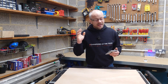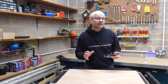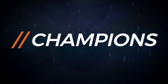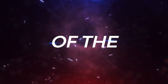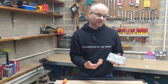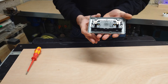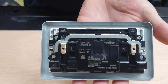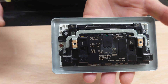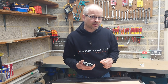Double socket here — it's an MK one. Not that the brand really matters, because what I wanted to do is just rip it apart and show you how it all works inside the back of one of these sockets. So it's a metal clad double socket by MK with USB. It's only a 15 watt output. It's a double pole switch. MK do also make a much more powerful one — up to 30 watts — and you can check out that video later if you like.